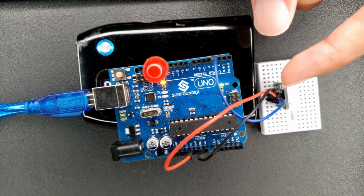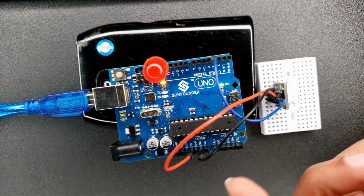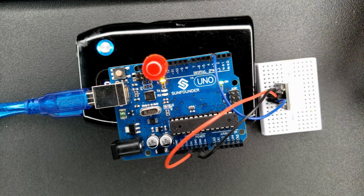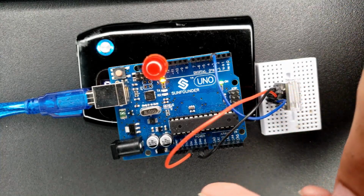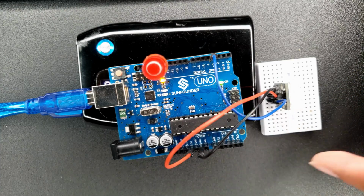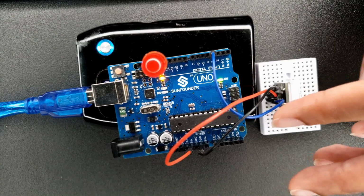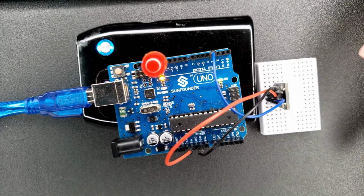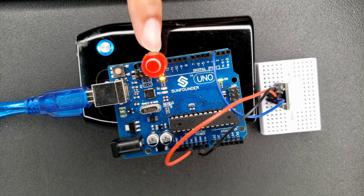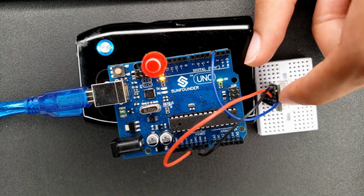Okay, so jumping into the construction work, as you guys can see all the way to my left hand side, I actually have my black wire, which goes from there to my ground, and I have them on the same exact line. Then right here for my next one, I actually have my red going into my volts. I just so decided to use my 3.3 volts. And then lastly, I use this one for my signal, which actually goes into my 4th pin. So basically, I coded it to activate the LED to go through the 12th pin and the ground. And typically, that's pretty much it.